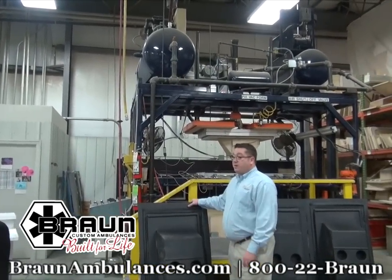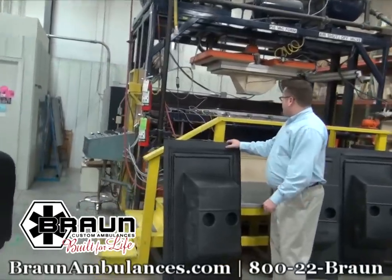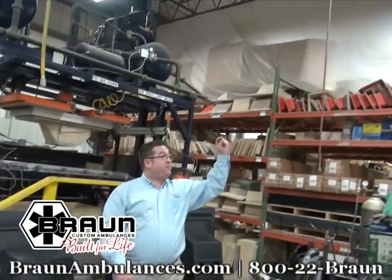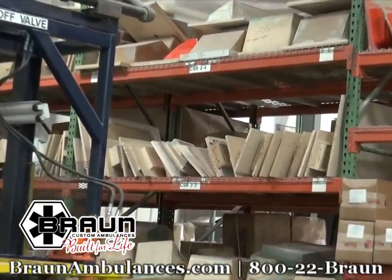We start off with flat sheets of ABS, heat them up, put it on, and then create the vacuum. We do custom consoles, closeouts. If you look behind me on the wall up to the left, you'll see all these wood molds, and those are all molds set up to do ABS thermoforming with.